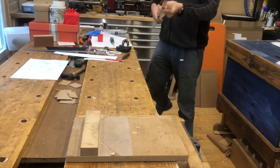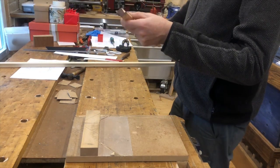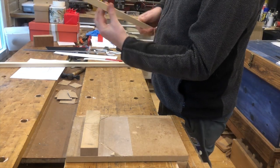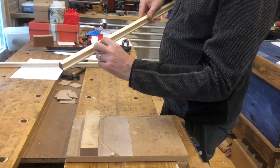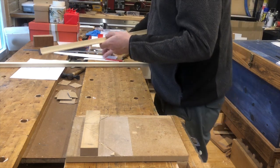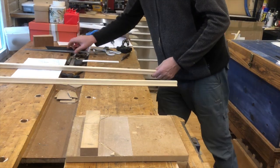Let's make these with plain wood. So I know you're not planning on wood now. You can make your own mouldings quite easily. Just rip the wood down to size. Cut a rebate in. 5mm is a good width for the mat and everything else to sit in. Sticks, 280.